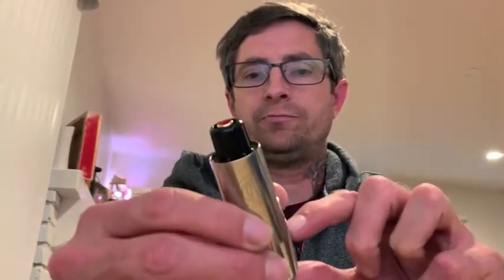Okay, I was watching the video, or editing it together, and noticed there's a couple of things I just wanted to clarify a bit more. So one being that when I was mentioning the weight increase, what I didn't mention is that the reason the center of gravity is dropped with the stainless version is that the bulk of the metal in this piece is from this point down, let's say. And most of this is very thin. It's less than 1 millimeter thick here. So what I'm doing by adding stainless, because the rest of this is actually still aluminum, is making a stainless grip, you're dropping the center of gravity down because there's a big chunk of metal down here.